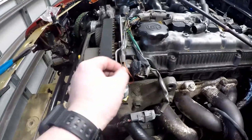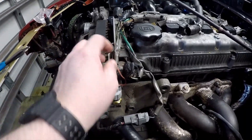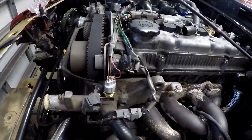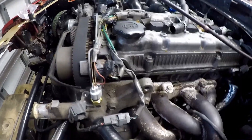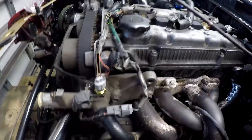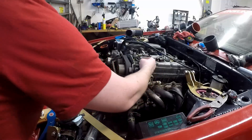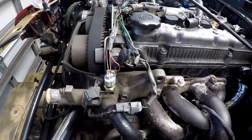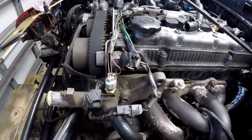The wiring can be really, really tight, as you can see, so it might also be worthwhile to just do a solder on a little extension, or take a spare piece of wire and crimp or solder back here. As you can see, this is really tight, and actually when I plugged this in I pulled one of the wires out of the pin — which really sucks because sometimes you can't really fix that and you have to get a new pin.